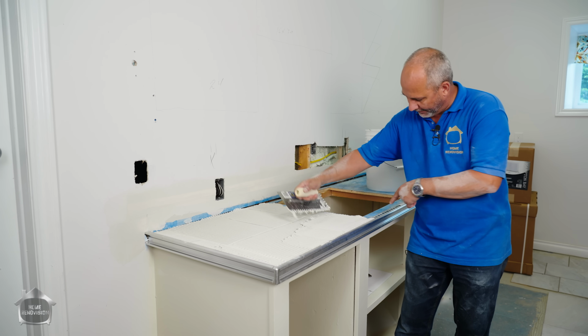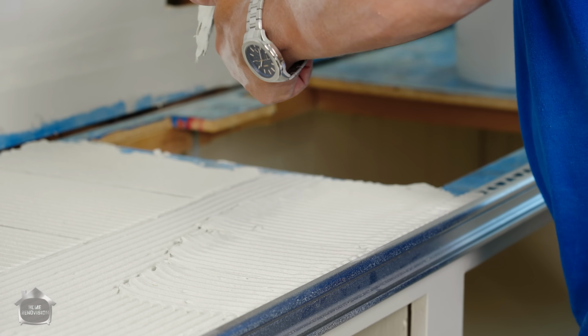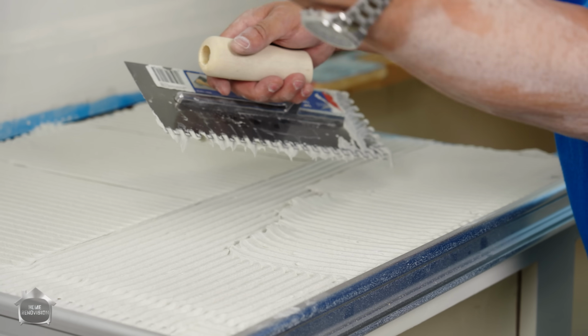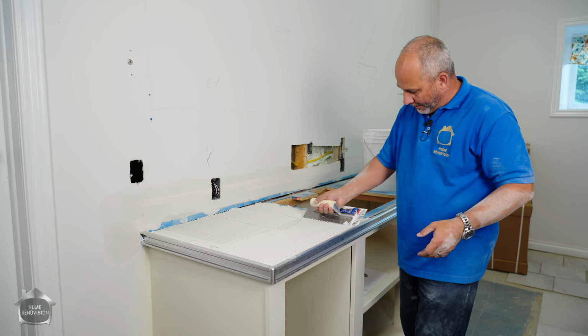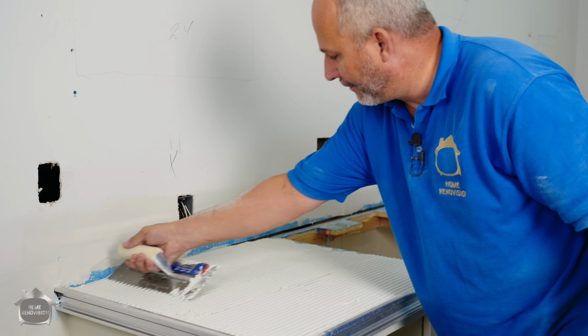And because I'm using this transition on top of the countertop, I'm automatically gonna be higher all around the perimeter. And that's okay because it's easy to squish out at the perimeter because it can go out and up through my grout line. All right, so this is actually not a problem. This is a good thing. All right, now, large format tile.